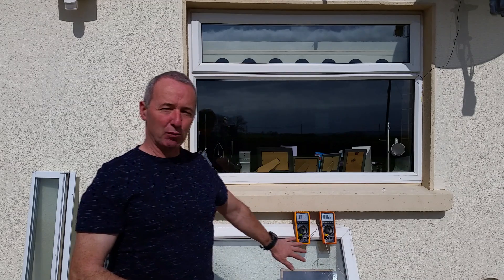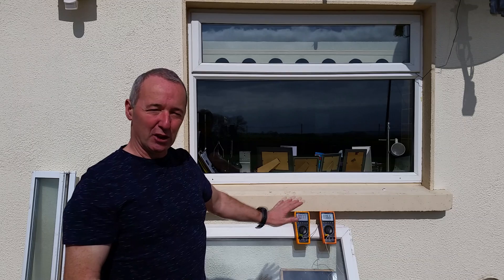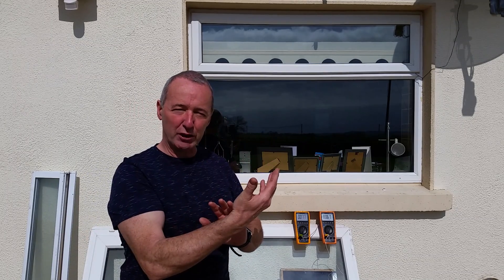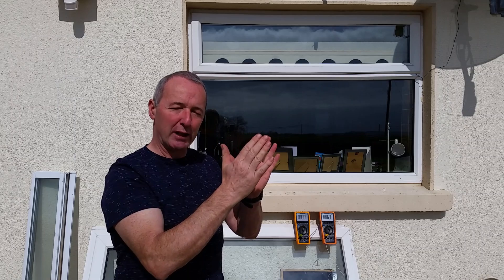There is a significant difference. What I've done here is I've got a double-glazed window pane, just a window taken off a job somewhere. I've made a little box behind that window with some one-inch insulation, high-density insulation, silvered on both sides, and I painted one side of it black. Then I stepped it away from the glass so that I could fit some pipe in. I've got two bits of pipe, so I'm going to show you that now.